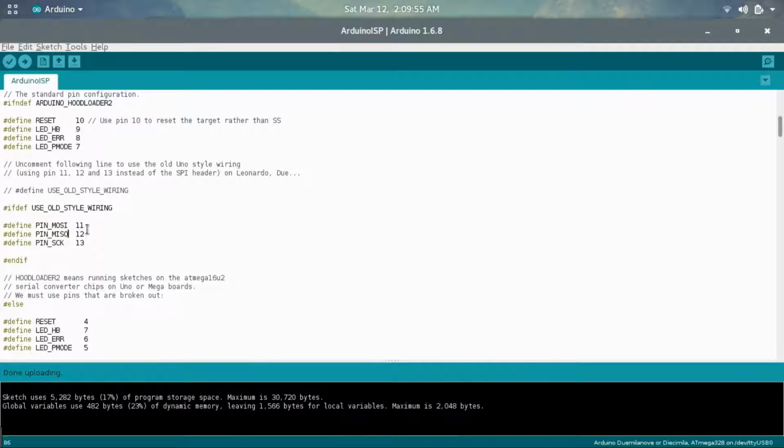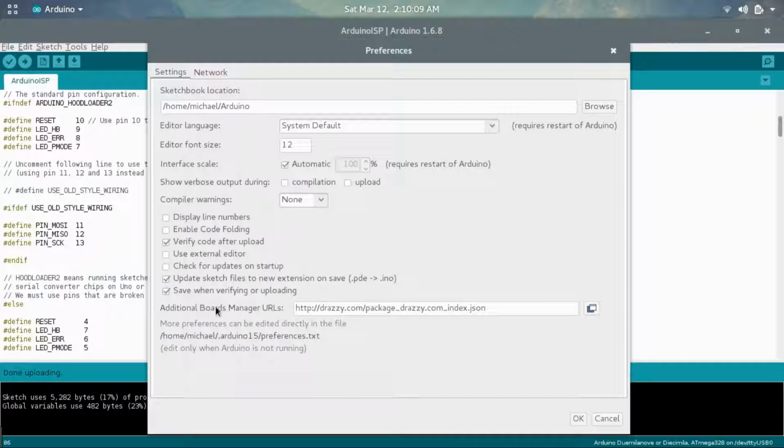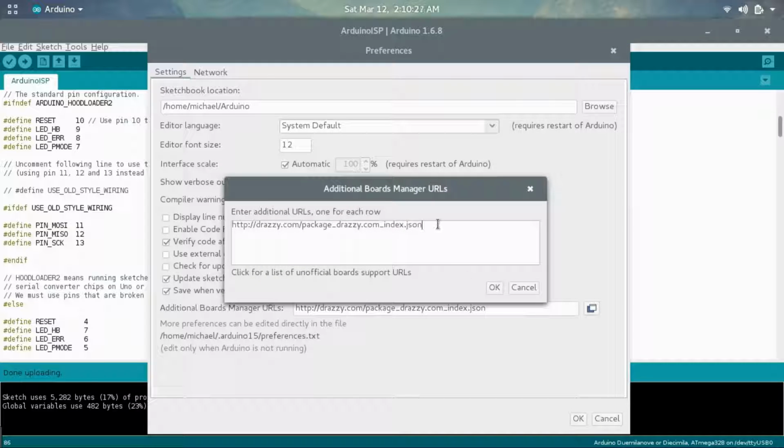After you get the board and all the wires set up, now we can move on to actually getting it so we can program it from the computer. Now when we go into File, what we need to go into is Preferences, and then under Additional Board Manager, now this is assuming that you have the latest Arduino. You should have Arduino 1.6.8, 1.6.7 should also work as well, but 1.6.8 is the latest. And what you want to do is go into this Additional Boards Manager and enter in this URL. And this will be in the description of the video, so you don't have to copy from this video.